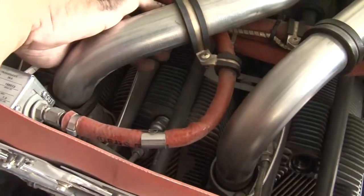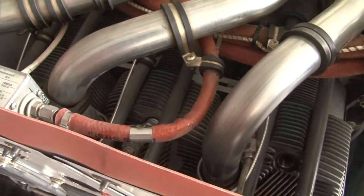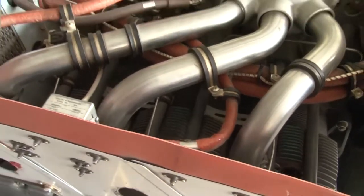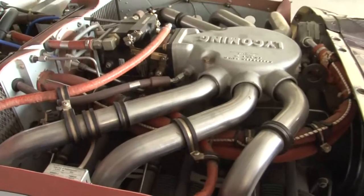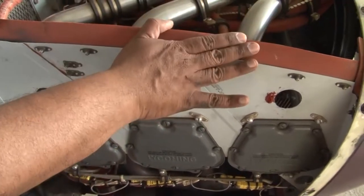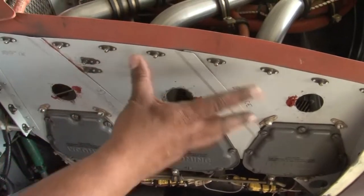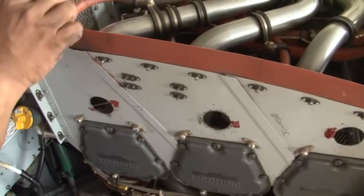These lines are very delicate, and we have to be very careful about these lines. We need to do a thorough visual inspection for the hoses, metal lines, and their fittings. Another inspection in the 50 hours is for the baffles and the seals. We have earlier also told you that there are metallic baffles and the baffle seals. We need to ensure that these baffles are firmly in place, they are not loose, there are no cracks. All the seals, they are properly in place, they are sealing.